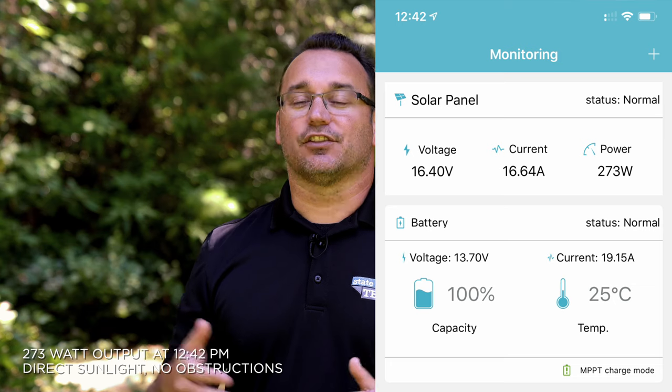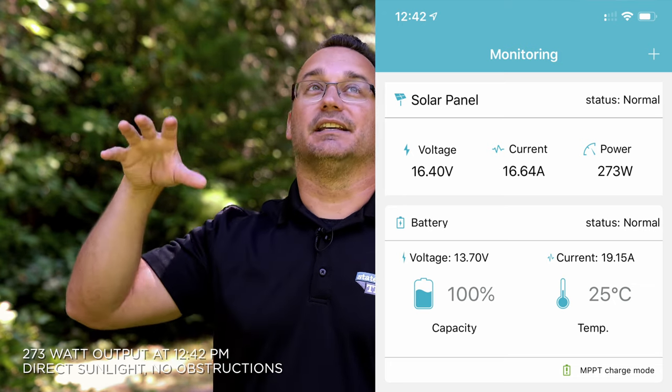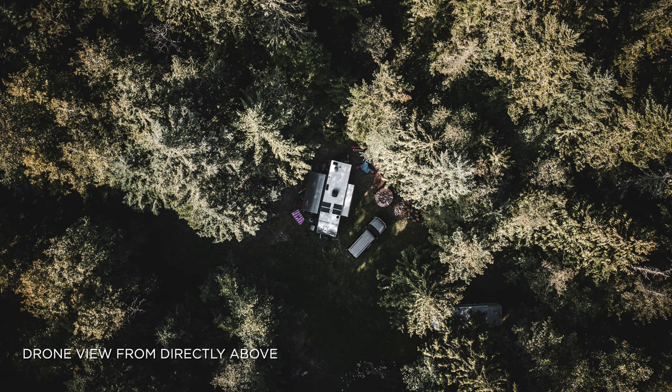Here's one important thing to consider when doing solar: just because a panel is rated at something like 100 or 120 watts doesn't necessarily mean you're going to get a full 120 watts out of each panel. Right now our trailer is sitting in the sun with four panels getting direct, unobstructed sunlight — an optimal situation for charging. However, with those four panels I get an average of about 280 to 320 watts depending on cloud coverage or haze.